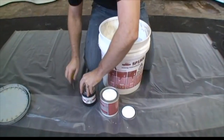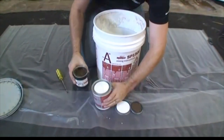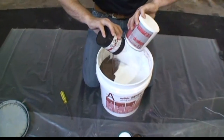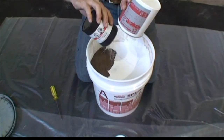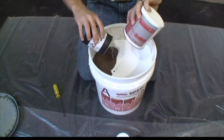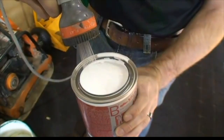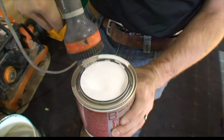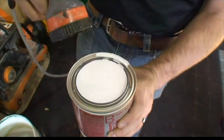Mixing the coating is easy. Coatings like Stripon 150, which are sold in buckets, get mixed in the bucket. Simply add the small container of Part B and Stripon colorant, unless the coating is already pre-tinted. The Part B container is a one-quart container, and in most weather conditions you will fill it with water and add that one quart of water to the bucket.